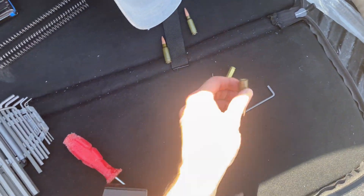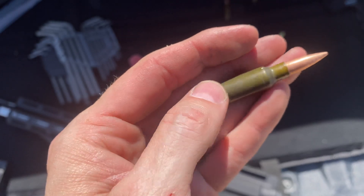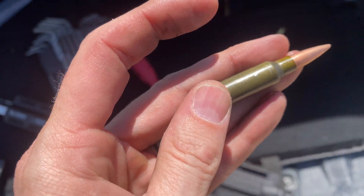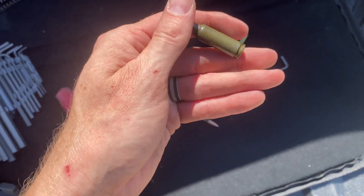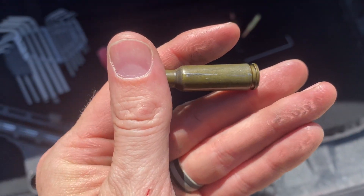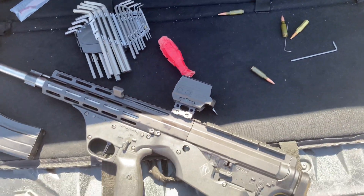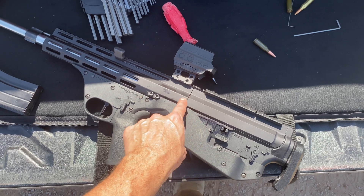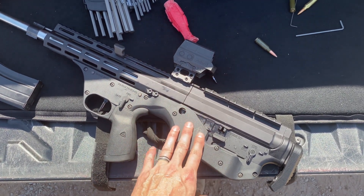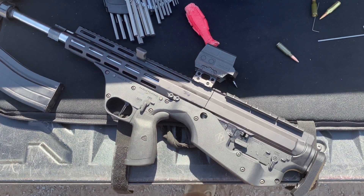It does not like the steel casing. You can see it's gouging up the steel case, making it hard. Scraping up, and I think that's what's causing it to not chamber. There might be something going on with the feed ramp on that barrel — I might need to polish something up or round off some edges to make it chamber better.